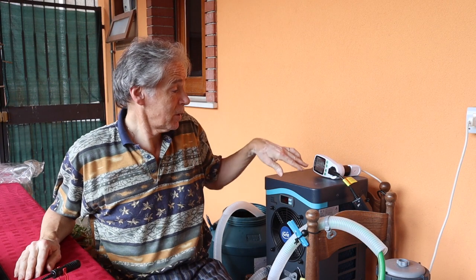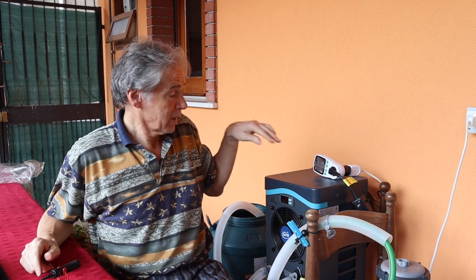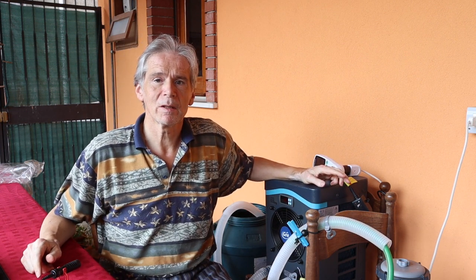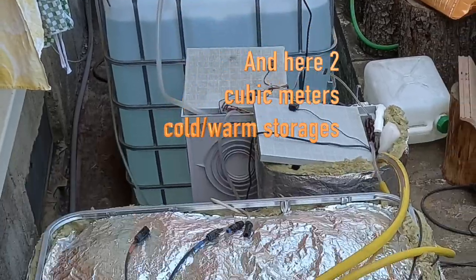I brought this heat pump with us. With the help of cold water from the grid we will have much better cooling of the condenser, meaning we will produce cold air with much more efficiency than a regular air conditioner. At the same time we can also preheat this grid water, which can then be used for example for the solar collector. Since each apartment can be full — up to 40 persons including ourselves — we need to produce cold air independently at any moment. Even when there is no grid water consumption, we have a water buffer reservoir to make this time shift.